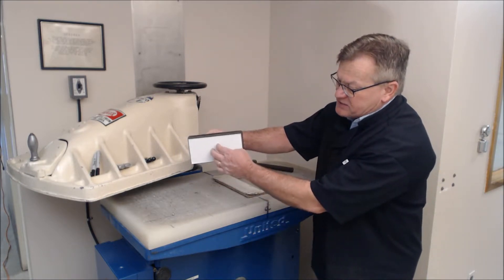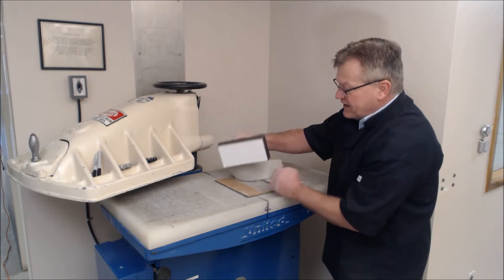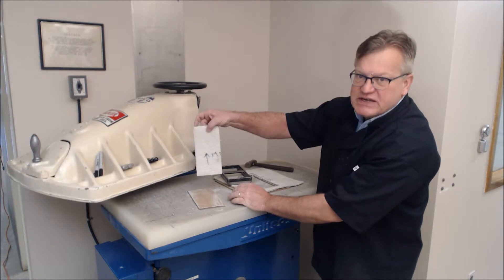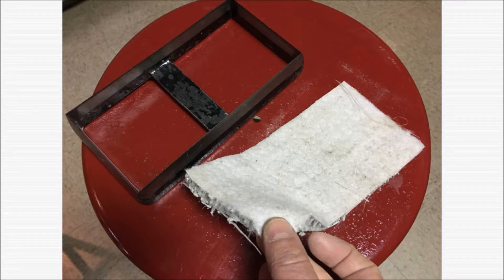That was 12 tons of pressure by the hydraulic cylinder. The specimen is now trapped in. You see the cardboard underneath — so you click the specimen out, and now this is one machine direction specimen ready to go into the continuous rate of extension machine and to be tested for tensile.